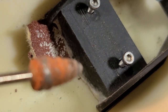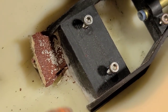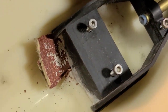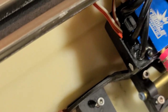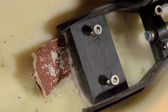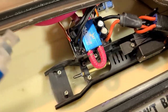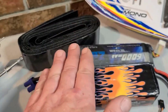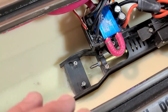It definitely is CA and baking powder — I was using my Dremel and it was smoking and you could smell it. CA has a distinct smell. So if this happens to your boat, CA and baking powder — but it'll break loose again because it doesn't have any flex. I've got my sandpaper under the motor mount roughing it up and getting most of that CA off. I'm going to do the velcro first so you guys can see how I do it while I have the motor out, then do the bonding last so I can weigh it down while it's drying.